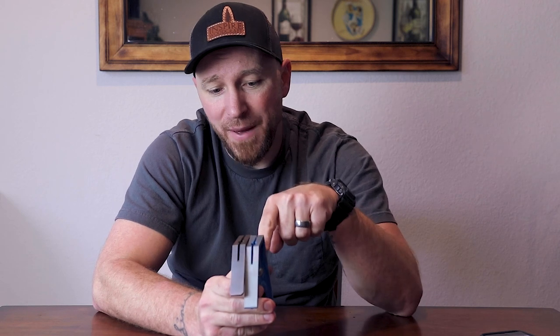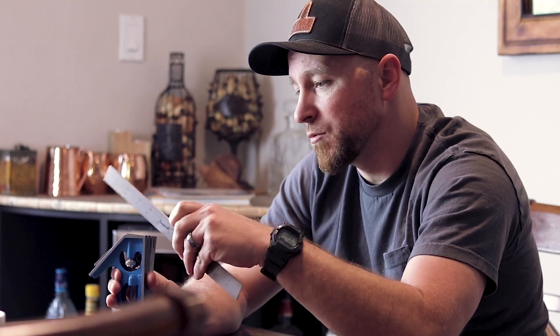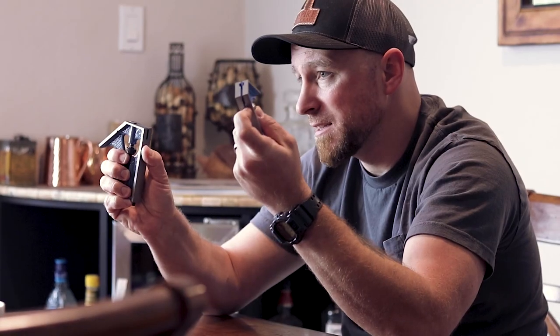As far as the heads go, it's cast iron typically on the upper-end ones and aluminum on the lower-end ones. On the inside of these grooves, there are actually little pads that are cast in there, and those pads determine whether or not this ruler sits square or not. As you wear these out, you can go through and adjust those pads to square it up — I'll show you exactly how to do that in the next video. With cast iron, it's not going to wear out nearly as much. The pads on the higher-end tools are also a bit taller, so not only are you not going to remove material nearly as often as you would with aluminum, but when you do need to adjust it, you have more material to work with. This means the high-end tool is going to last a heck of a lot longer, because the aluminum is actually being whittled down a lot faster, and these have a shelf life.